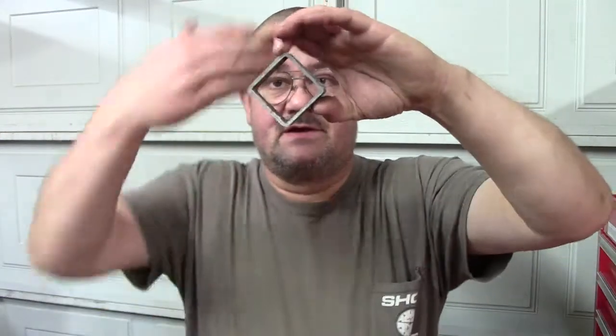So there we go — that was the idea of the video. A use for V-blocks other than just in the mill. I also use V-blocks when I'm cutting round material because you have two contact points. If you don't want it to spin or you have a short piece, you can put two on each side — four contact points — just open your jaws wider. Any little thing you can figure to make things go faster. Cutting when you have less contact in one spot is faster, and you saw how you could stall it out if you let it drop too fast.